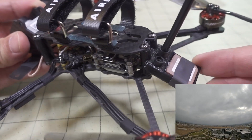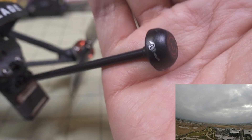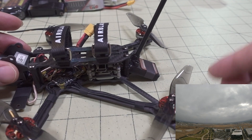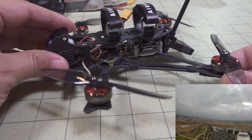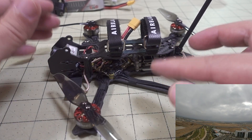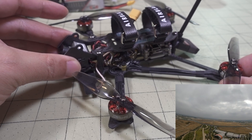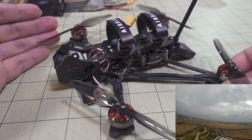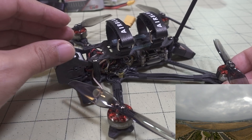There's a 3D printed part here for the GPS and the antenna. I'm using the Flywoo Atomic Antenna — left-hand polarized and extra long at 15 centimeters — to get a very good signal away from the frame for pretty good range. This frame is light because it's only a 2.5mm bottom plate and a 2mm top plate, with no separated arms requiring extra hardware. The upside is it's very light; the downside is a hard crash might break something, but Airblade has done a lot of crash testing and it's held up well as long as the all-up weight stays fairly light.